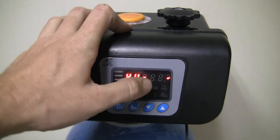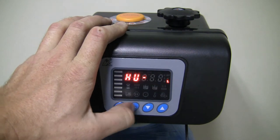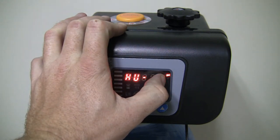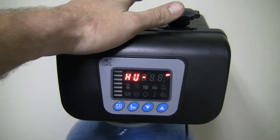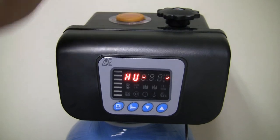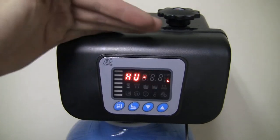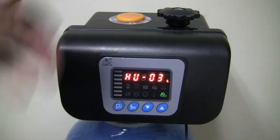Press set once — you can see it's flashing along with the little spanner. I want to change it to liters, which is HU03, indicated by a little 'L'. If you prefer gallons, you press to HU02, and it'll give you the gallons that have gone through the softener. This valve head — versus the B1 model — has a nice feature where if your flow rate through the vessel reaches a certain amount before the number of days set for regeneration, it'll trigger that regeneration. I'm happy with liters, so I'll press set — now it's locked and will measure flow in liters.